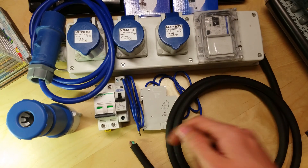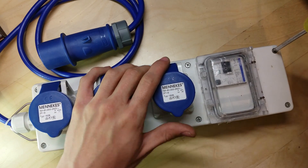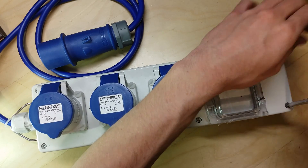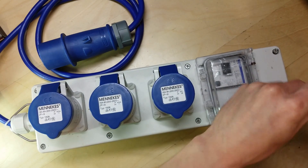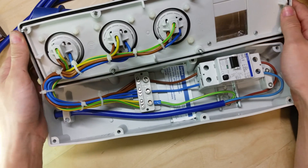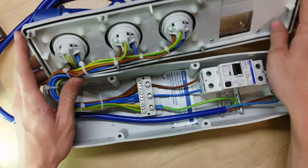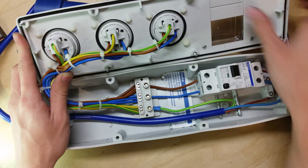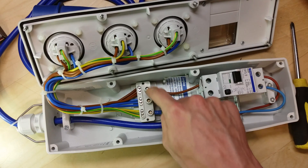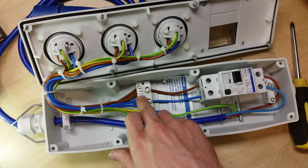Enough talking — let's crack this thing open and get the job done. To take it apart is quite easy; it's just a case of undoing all of the screws on top and the top piece just lifts off. You can now see the guts inside the unit — very neat and well made. I was quite impressed. I'm also going to have to change this terminal block because if I'm splitting these sockets onto two breakers I can't have them all going to the same terminal.